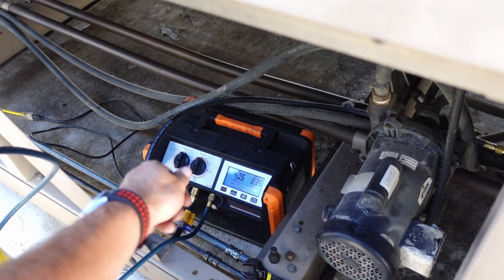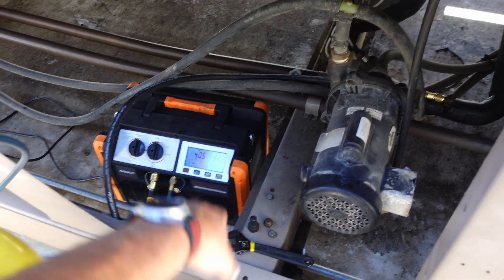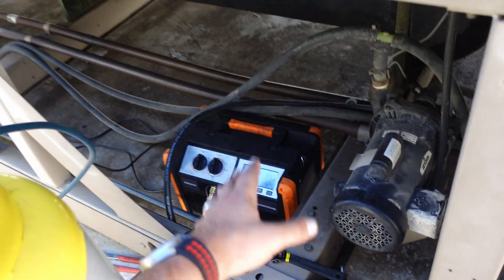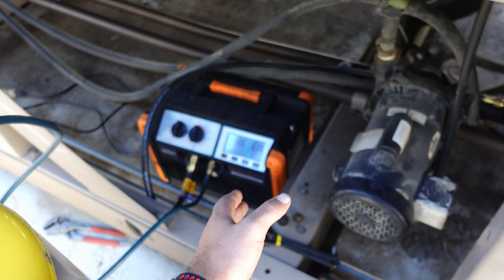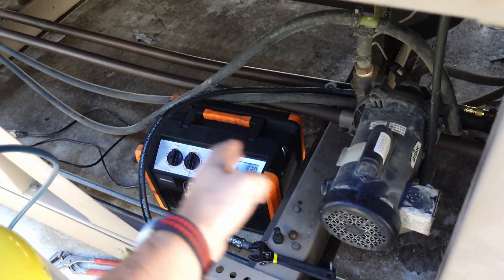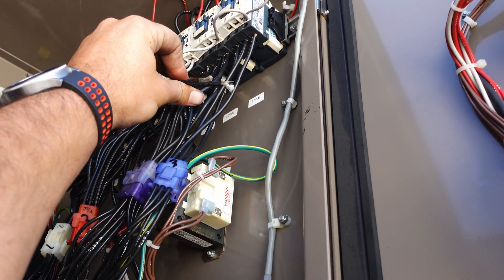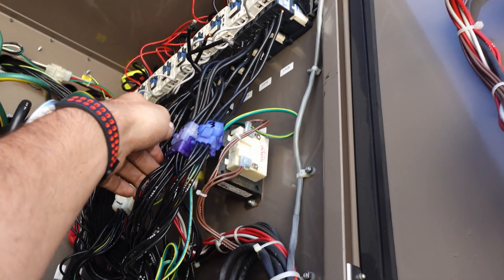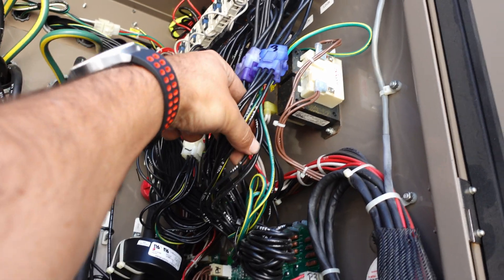If it gets to shaking too bad we'll turn it down. What we're going to be monitoring is what does our output pressure do? Because normally with a subcooler on 134, I can keep my output pressure at about 200 PSI with my water-cooled subcooler. So can this air-cooled cooler compete with that in any way? We're in the process of changing the fan out. Something we do on occasion to get us by — you can pull those leads off and set them to the side and you can still run with just one fan down. I've even had success with two fans down.